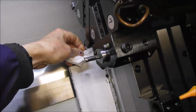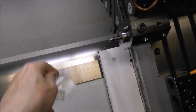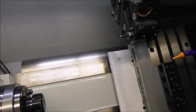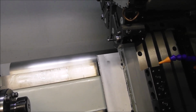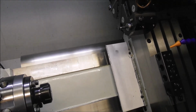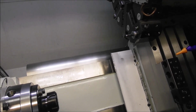and then clean that surface behind there with a clean cloth or a tissue, and then run oil over that surface with a clean hand, clean finger, and wipe it on that surface. If you do that at the start and the end of each day, and once or twice during production, it's only a few minutes work overall, and it will give your lathe or machine tool much longer life. You might get 1% of the wear than you would if you were unaware of that Achilles heel vulnerable area and just neglected it, because the wear rate is exponential once it starts. But if you stop it from starting, your wear may only be 1% as much.